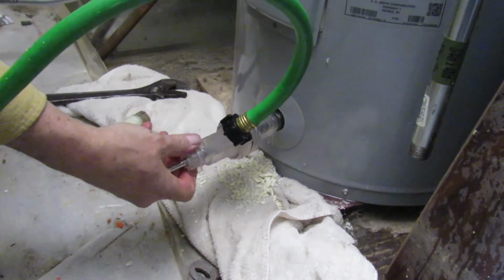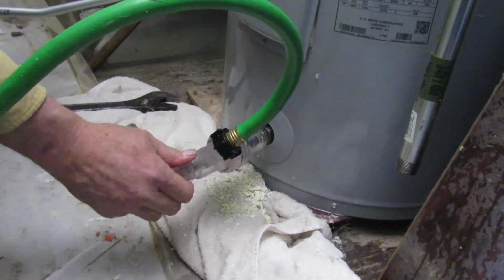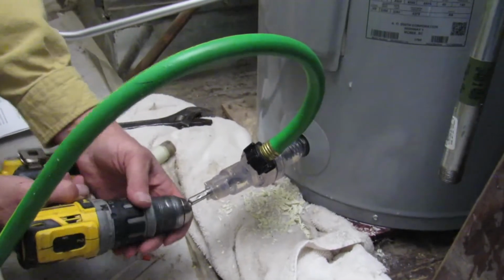Now open the water heater's cold water supply valve. Water will flow through the tool and hose. Monitor the seal nut's tension during the process. You may adjust it to prevent it from over-tightening or leaking excessively.